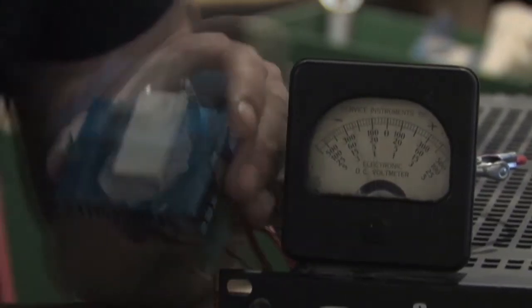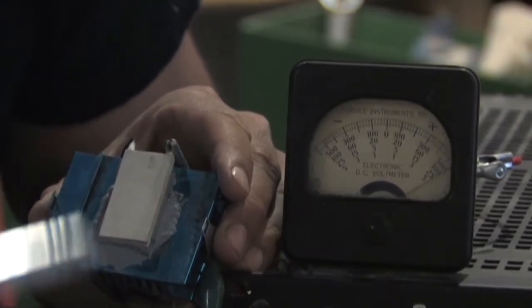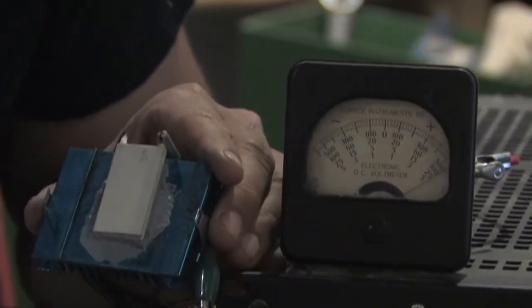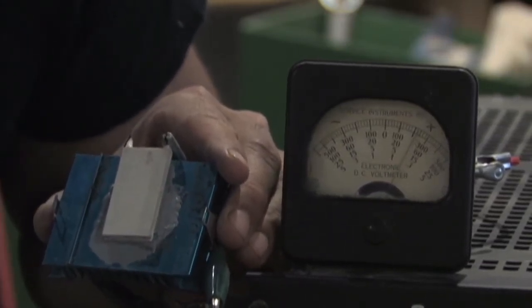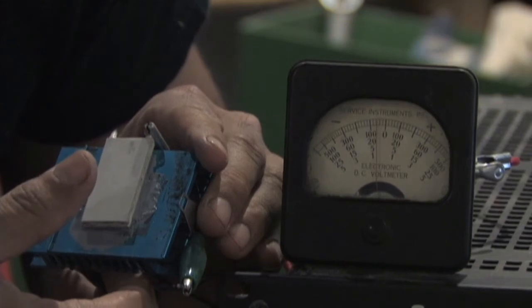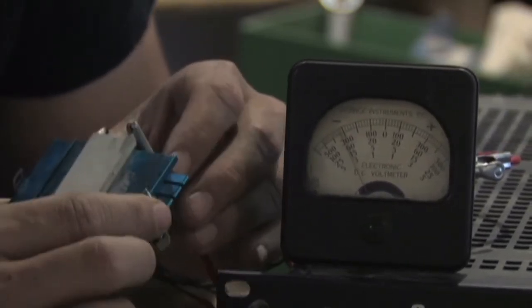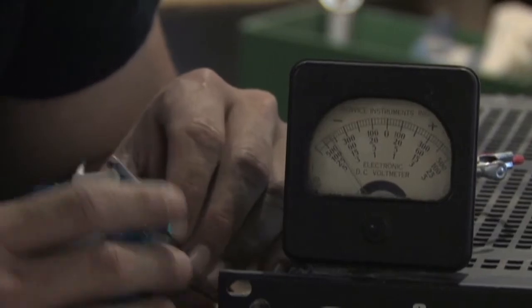You can see the voltage goes up higher. Now if you take a heat source and apply it to it, you can see the needle goes all the way over. It's still actually creating a current right now — the heat difference — the needle's all the way to the other side. And then as this cools down, it starts to come back down. The same thing will happen if you put an ice cube on one side and just room temperature on the other — it'll actually go all the way up. This test is sensitive to which side you put it on, but you can just switch the leads if you want.